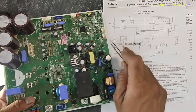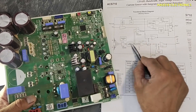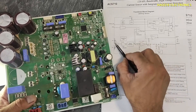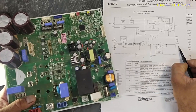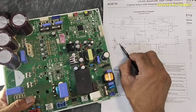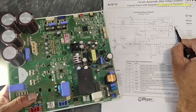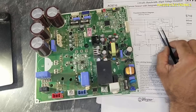If we adjust it to 15 ampere, when the primary current tries to exceed 15 ampere it will create a fault condition. The normal voltage will come out from this point — for 10 ampere, proportional voltage will reach here. These are linear voltages because here is a linear Hall effect sensor, so the microcontroller will receive these two signals and if there is any abnormal condition it will provide an error signal.